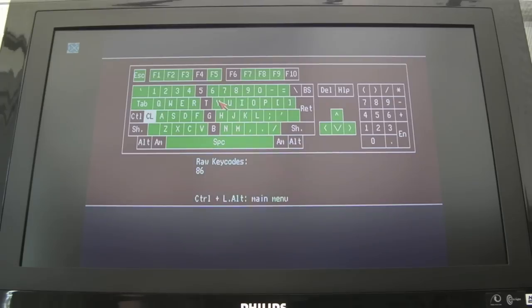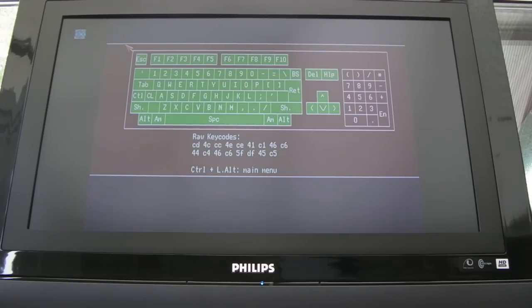Like the 8 rows not working there. So at the very least it needs a new membrane. Well, this is very strange. What I ended up doing is reseating it a few times. Still no different. You know, still had columns not working.